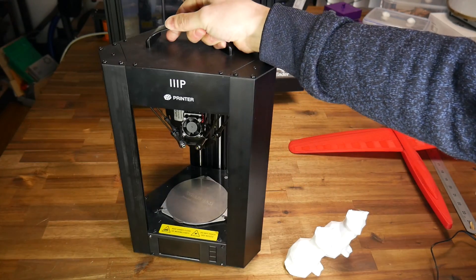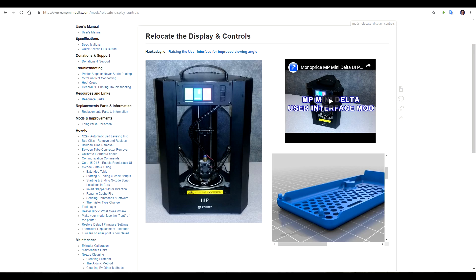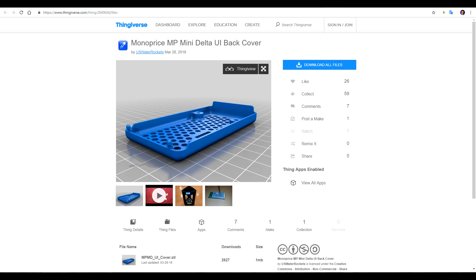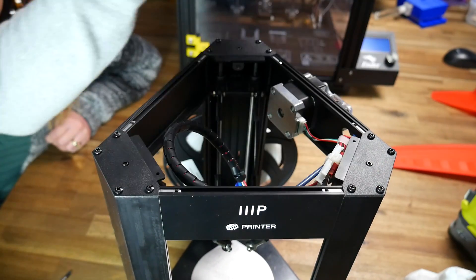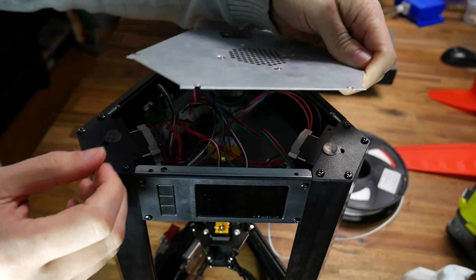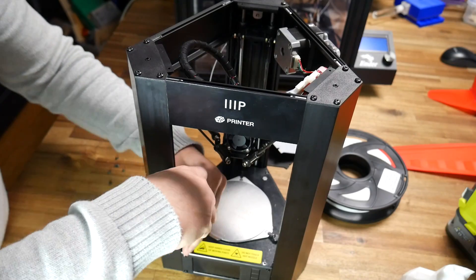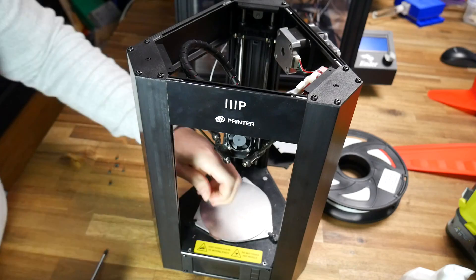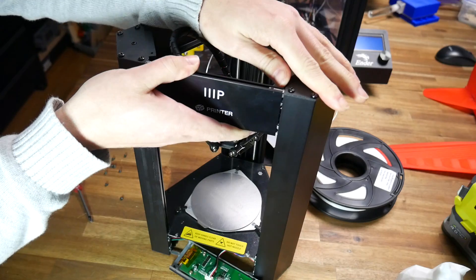So at this point, I was pretty chuffed with the changes I had made to the printer, but there was one niggling thing, and that was the access to the LCD. Then I remembered I'd seen on the wiki a nice link to a Hackaday article with a YouTube guide for moving it up to the top, as well as the printed part you needed to protect the back. Fitting this was fairly straightforward — you simply need to remove the screws off the top of the printer, then flip it upside down and do exactly the same thing underneath. You do need to take care to unplug the fan to avoid ripping out the cable. The front panels both have two more bolts on the left and right-hand side that, once removed, allow the LCD as well as the blanking panel with the logo to be removed easily.